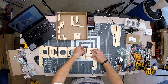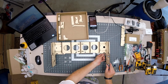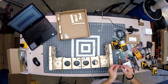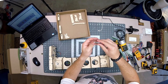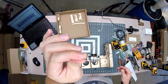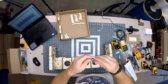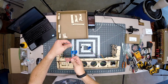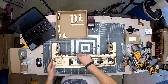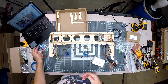There was one screw while installing the gantry where it helped to have a bent screwdriver if you have one. The rollers with the larger hole won't need to be tightened down at this stage as they'll need adjustment to get onto the rail. At the time of my install the picture made it hard to tell there was an extra nut on this bolt — you'll have three bolts with two bearings, a nut, and a washer. Make sure to label your cords, because when you wrap them you won't be able to tell where they're going. After installing the two homing switches, you'll realize there's one more — set it aside for later.